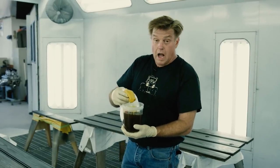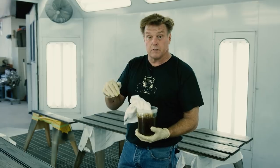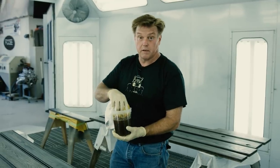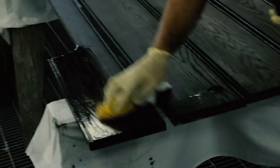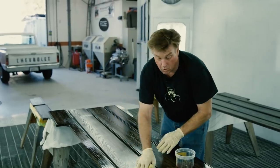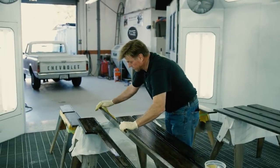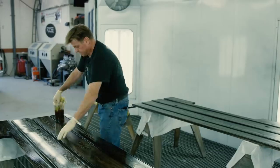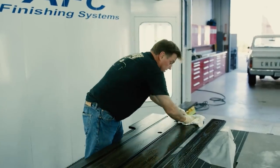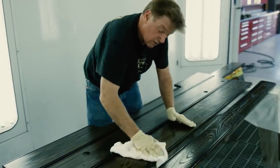To finish the wood up I've got some teak oil here. I like oil rather than an actual clear or varnish because if you get some penetration underneath the clear or varnish it'll start to lift off the wood and you'll have to refinish it. With the teak oil, I can just come back and re-oil the wood anytime right in the bed — I don't have to pull it apart. I'm putting the oil on real heavy here at first and letting the wood just absorb it. After I get it all on, I'll come back with another rag and dry it off so it looks nice. I've got a dry rag and I'm wiping it down, then I'll let it dry and give it a few more coats.